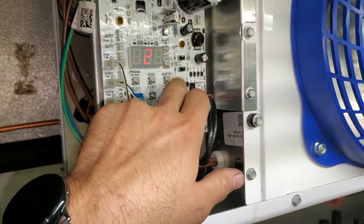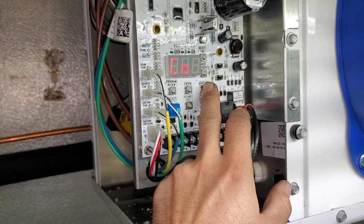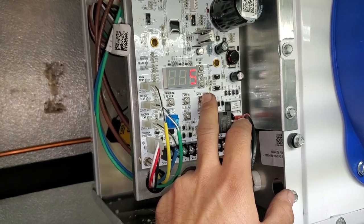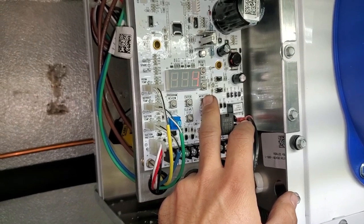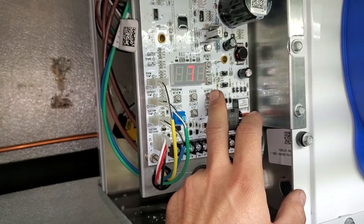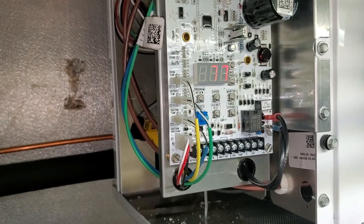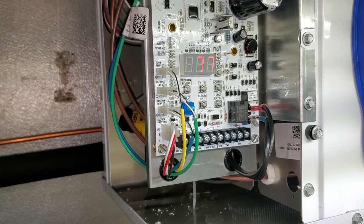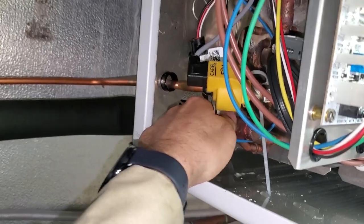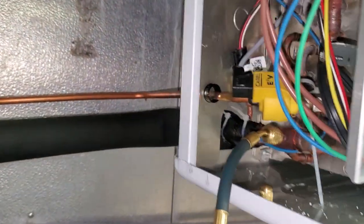This is strange because I'm not seeing anything wrong. Let's start back at the beginning — suction superheat. That's cooling mode, 42 degrees in the box. My superheat currently is five degrees — we're running kind of low right now. A minute ago it was at 15. Suction pressure — it is not 77 PSI suction pressure. That's our problem. We do not have 77 PSI. We have like 50 PSI. We'll have to verify that. Let me put a gauge on this. That is a problem. 51 PSI and the unit says 73 PSI. So there's something wrong with that transducer.